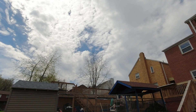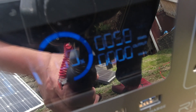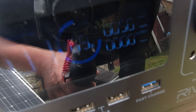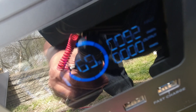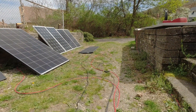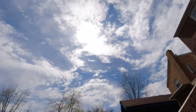The next thing we're going to do is get some solar output readings. We're doing a lay-flat situation. It's bright but with clouds — sitting at about 57 to 60 watts. Now if this is in Wi-Fi range I can use the app. Right now we're at 77 watts and going up. Almost 80 watts for the 120-watt panel — 82 watts with the sun peeking through a little brighter, and that's just laying flat. I'm going to make some adjustments and try to get the best possible angle on this bright hazy day.